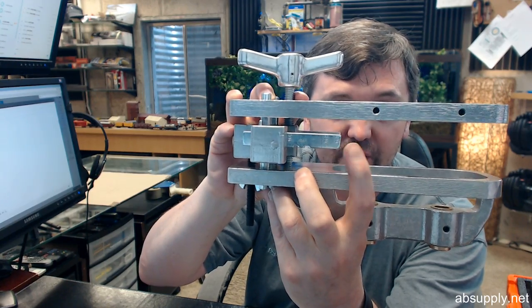If you have a bevel on the door, be sure that you're installing it in the proper way on the door to be compliant with the bevel. Otherwise, your back set's going to be a little bit off. So absolutely check that first. Okay.